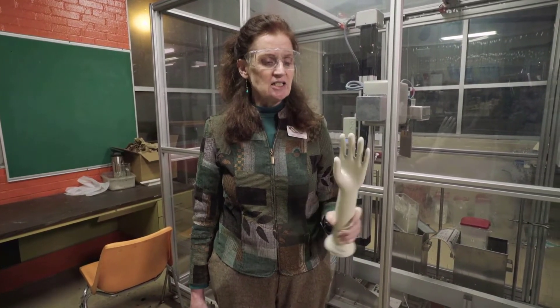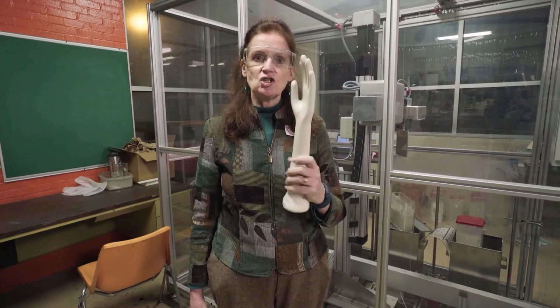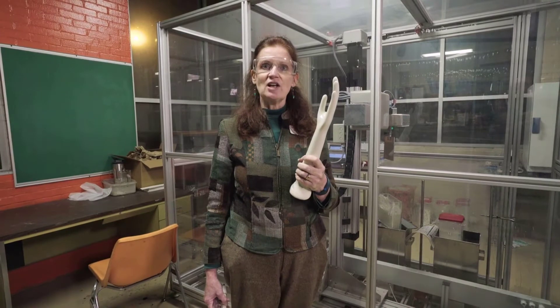In this case, the product isn't molded by compression and heat like in the oven — it's dipped. It takes on the shape of whatever you dip into it. This is a surgical glove former. When you dip it into the latex and bring it back out, it's coated in the latex and we then turn that into a glove.